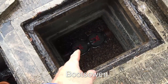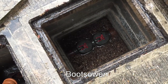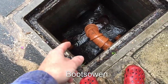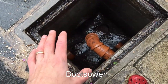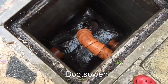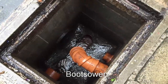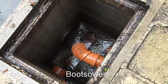So today I'm going to climb down here and open up one of these two non-return valves, but before I do that I'm going to flush it through. The reason I'm doing that is because periodically I open up this manhole cover just to take a look, and today for the first time in years — about seven or eight years since I put in this manhole — there was toilet tissue up around the sides on that shelf there. That means at some point it must have backed up a little bit and the tissue got stuck on the sides, which isn't cool, and then it must have opened up again, which is kind of weird.